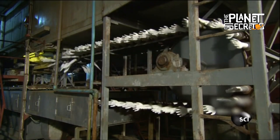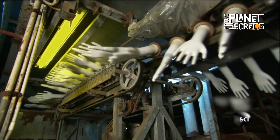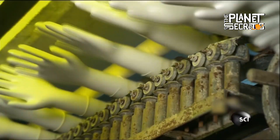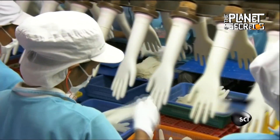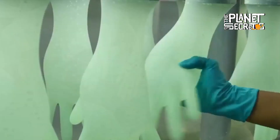After this, they go to a brush mechanism, which is responsible for winding one of its ends. All this so that the gloves can be manipulated more easily when they are removed from the ceramic molds, which is generally accomplished using pressurized air. Once these steps are complete, each glove goes to the test area, where they are stretched and inflated to verify that they have no holes.